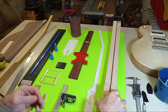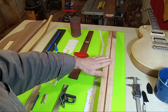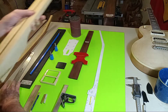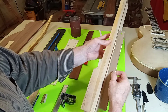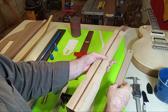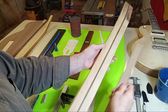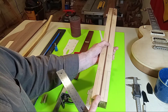As I mentioned early on, the most important part was to rough these leaves out of a quality board and then let them sit and watch them. If they did not move and stayed nice and true on the level, that's probably the most important thing. If they start twisting, they're probably never going to revert back to straight, so discard them. Once they're nice and true and level, you're ready to rough out your Pao Ferro, cocobola, or another piece of maple.